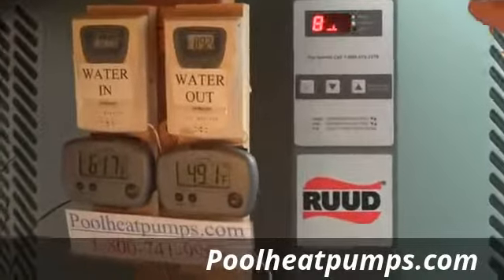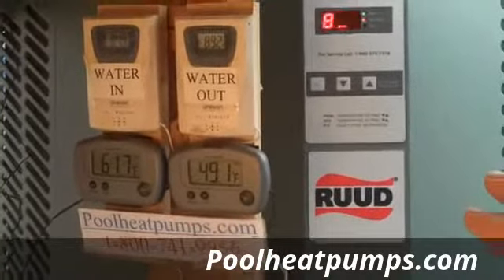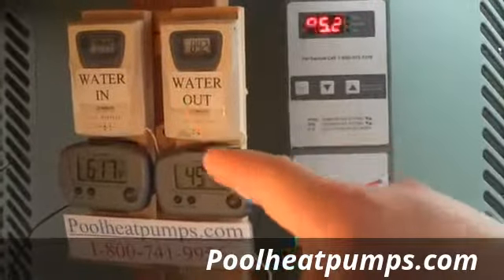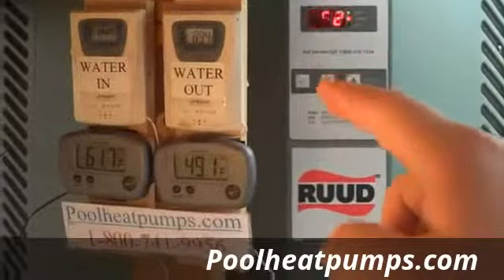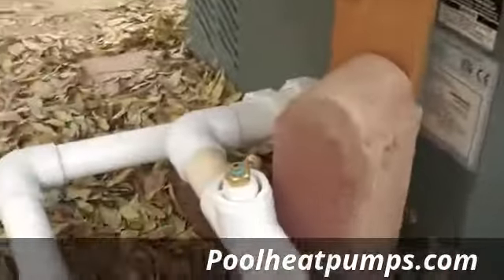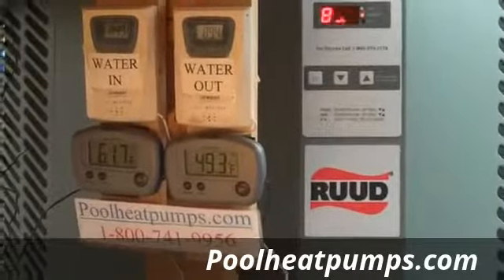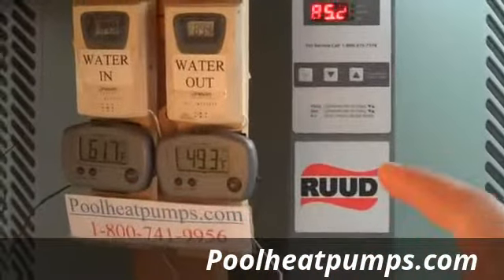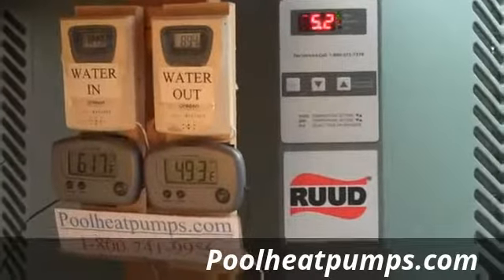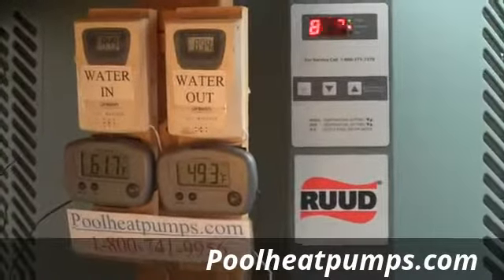What's important to check out are all the temperatures I've got set up here. Sometimes on video the digital display on the heater will flash and rotate, but on the actual heater itself it's perfectly constant — it does not flash or do anything weird. So we've got water temperature going in at 84.9°F, coming out at 89.4°F in the return line. The heater is instantly adding 4.5 degrees of heat to the water. The air temperature going in at 61.7°F and coming out at 49.3°F — so it's taking about 12 to 12.5 degrees out of the air and putting 4.5 into the water, which is really a great achievement, especially at only 61 degrees with such low humidity.